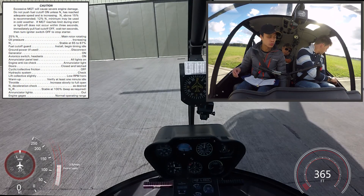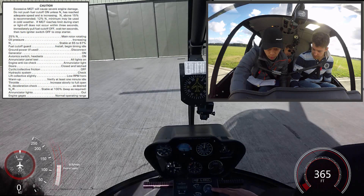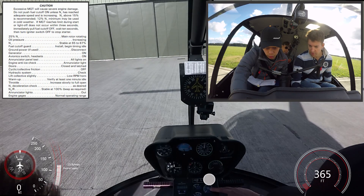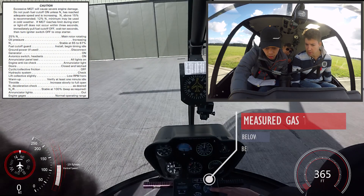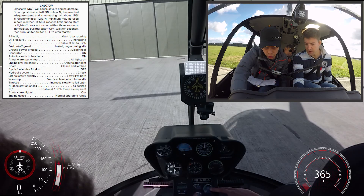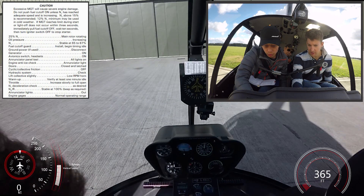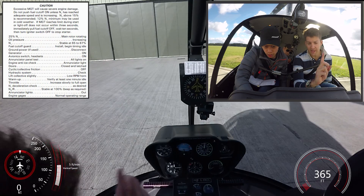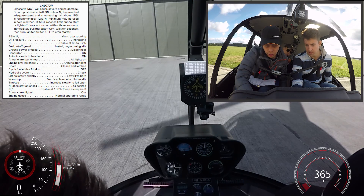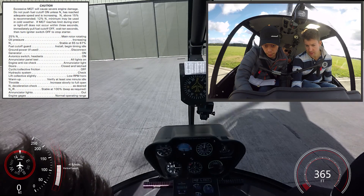Clear! Trent, in your own time, sir. Press the starter button. We've already got up to 10% — 10%, 12%, 13%, 14%. That's good. Less than 150 — go for it. Keep your hand on it. Looking at the start. The blades are beginning to turn. The oil pressure's coming up as N1 goes past 25%. It's gone for its first burn — it's coming back down again.